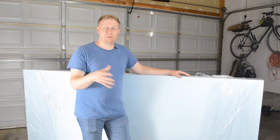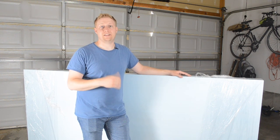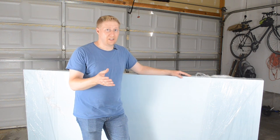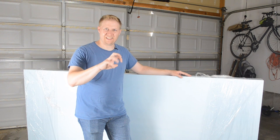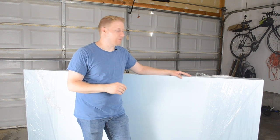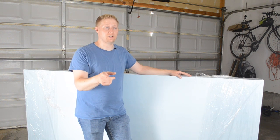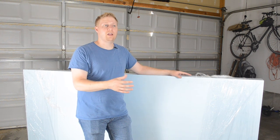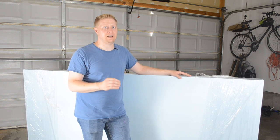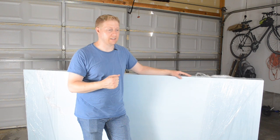The stuff you get there is typically 15 PSI foam, and it's a very, very lightweight, low-density material. They also have the expanded polystyrene, which is different. It's like the beaded white stuff. You don't want that stuff either. It's even worse. It's not a good structural material. In fact, I used the 15 PSI for my kayak paddles. It worked pretty well, but if I could go back and do it again, I would absolutely use High Load 40 or High Load 60, which is even higher density.